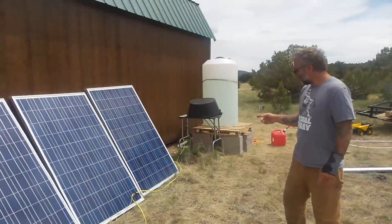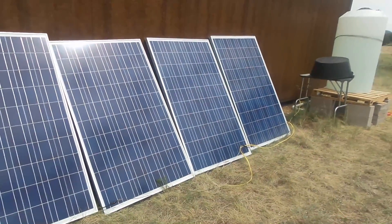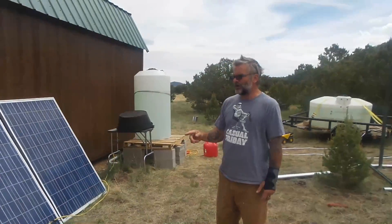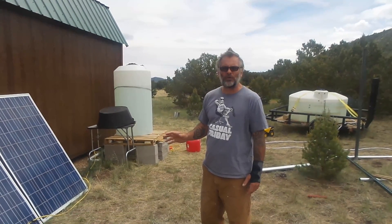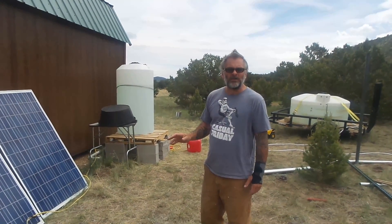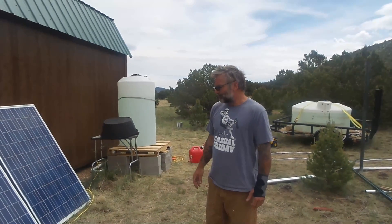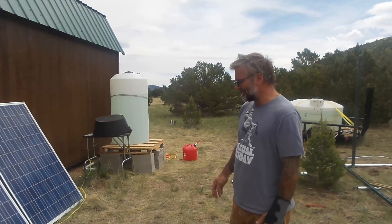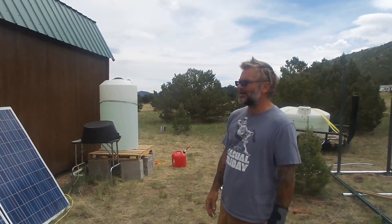What are we getting? Do you remember what we were getting out of this? I've got four panels here. We tried hooking up three and we were pretty low on the charging voltage, so we hooked up a fourth one and came in about four or five volts under our maximum - right around 140 volts. So we're doing really good. I just used alligator clips because that's what I had handy at the time, and I plan on moving these, so that's a temporary setup.